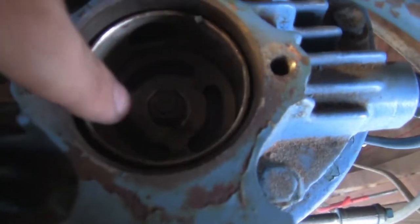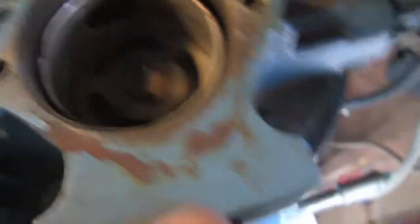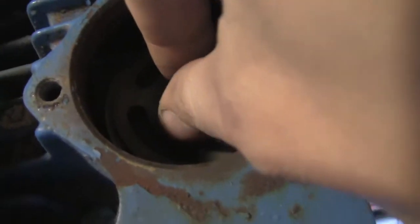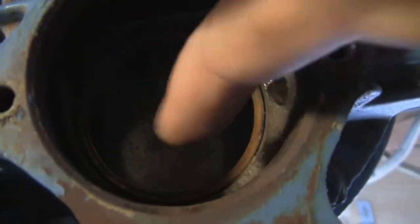See how this seals? It just has an O-ring in a groove on this top plate. Down in there, there are retaining rings on each of them. So you pick this retaining ring up and out. There's our retaining ring. Then our actual valve is down here. Notice how there's a nut on each one — it's very important when reassembling that the nut always goes up, otherwise it would contact the piston. The valve comes out, and we'll pop them apart, at least one of them. There's also a little copper seal ring down in there.